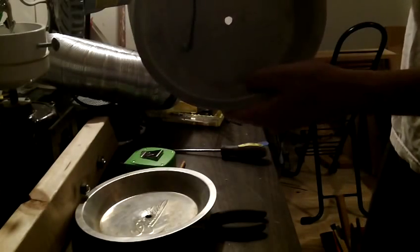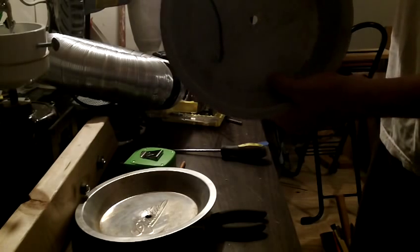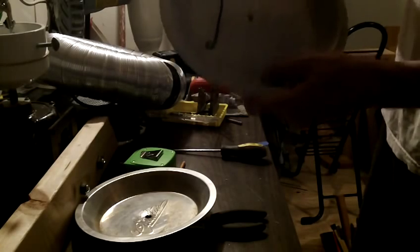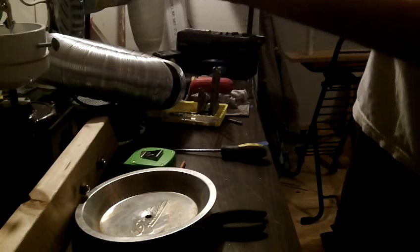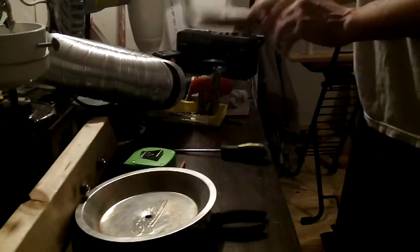In one pie pan, you're going to put a wire — you can just leave it bare. I like to use terminal leads. You're going to need to bolt that wire to one of the pie pans. This is going to be the pie pan that goes underneath and leads to the secondary. Put that aside.